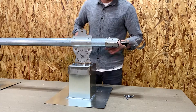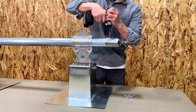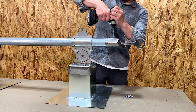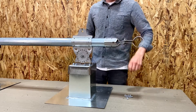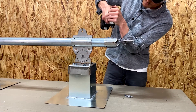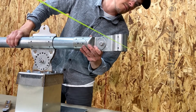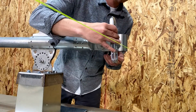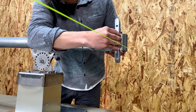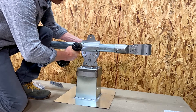Use four S10 screws, but the shop drawings will specify how many screws are to be installed in each assembly. For installing tek screws: use a cordless impact driver — cordless drills will work but the impact driver works better. Don't use large electric drills because they don't stop quickly when you release the trigger and it'll break the screw head. The screw is properly installed when the shoulder seats against the substrate. Rotolocks make for easy alignment to other frames. A straight layout typically uses a laser or a string for alignment.